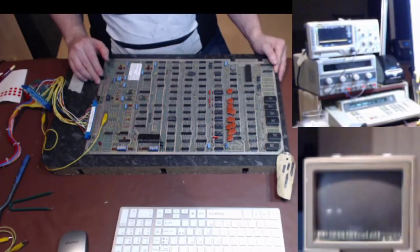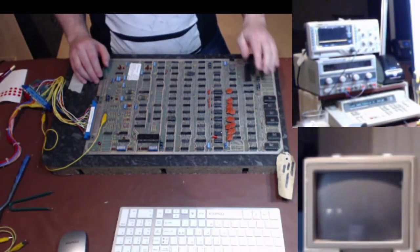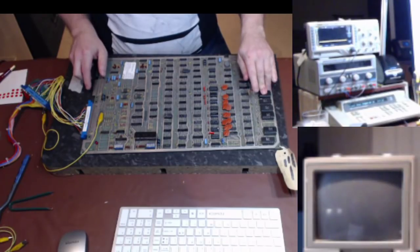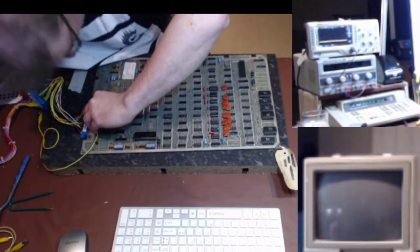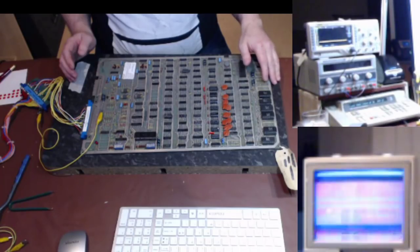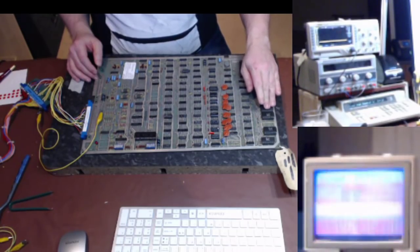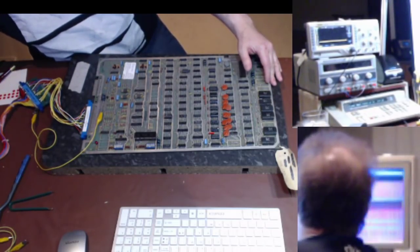That's telling me I've got multiple RAM failures. To ROM fail. Let's reset. Let's do a full reset on that. That was an interesting one, I've never seen that one before. There we go. I thought we've got a V-Sync issue as well to go with it. That low grumbling tone tells me V-Sync isn't working particularly well.